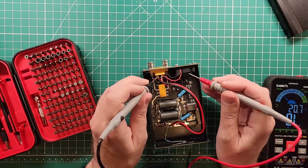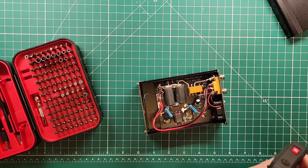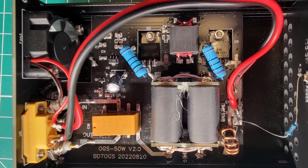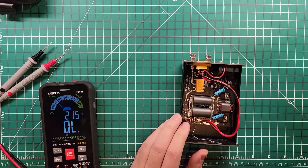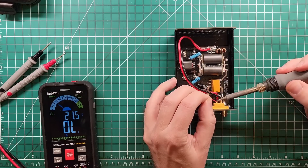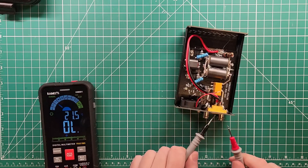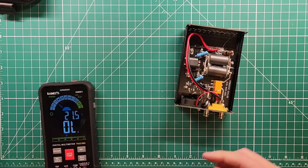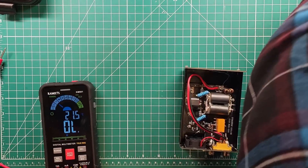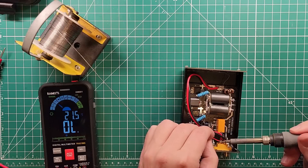Dead short at the circuit board - more research is necessary. What I'm going to do is start removing parts and see where that leads us. I'm going to take this fan off, which is directly connected to the power supply. I'm pretty sure it's not the fan that's shorted here. Fan is done - are we still shorted? Of course we're still shorted. Let's put that back on since that wasn't the culprit. And whatever they did soldering this together - I bet they're using lead-free solder, but that's a mess. Yuck.